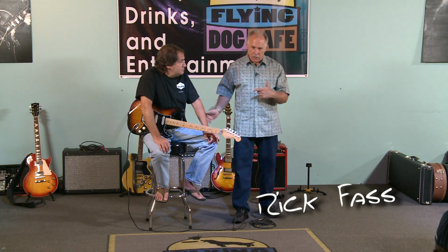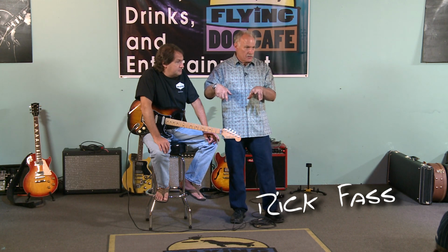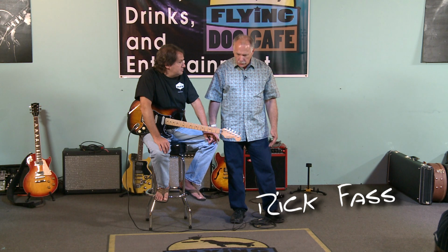The blackface run mid-6s, and then the specials are a little bit heavier, almost approaching a P90, and they're probably high 6s, low 7s. And then this one set, in fact, what Rich has on his guitar is called a Dirty Blonde set. It has the special on the bridge and then 2 blondes in the middle and the neck. And it's just a great, great flavor.